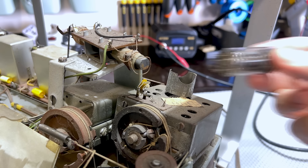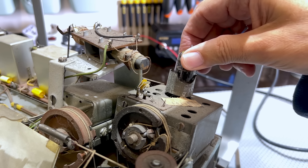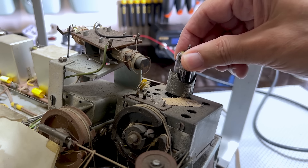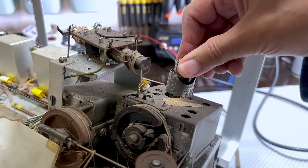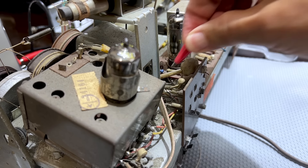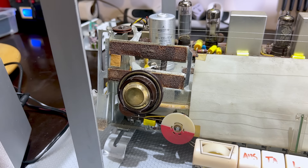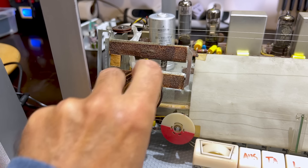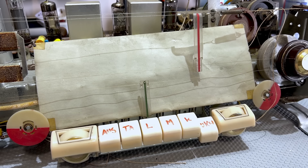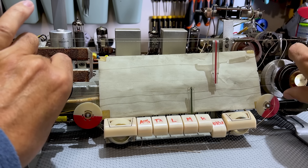Time to get the FM tested. I have cleaned the pins of this tube — the ECC85 dual triode, a very typical front-end tube for these German tube radios. It acts as a sort of all-in-one front end for the FM. So that tube is in, pins are cleaned, socket is cleaned. I'll put a little antenna on here — just a piece of wire. I'll switch it on at the dim bulb with one bulb, so very restricted. Put the volume on max and let's hit it.